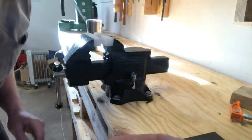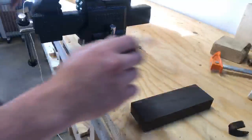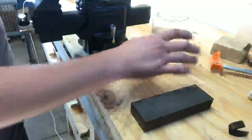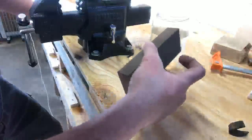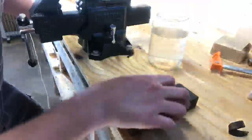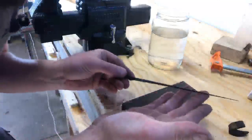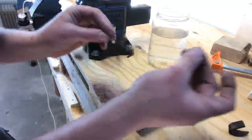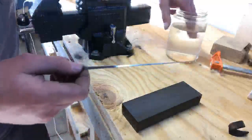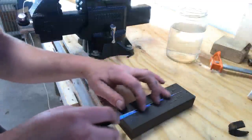Handy dandy vice tripod. Okay, that'll do. Next thing, this is a Norton India stone. I think it's medium fine. I use it for honing because we've done all the metal removal that we want. Now we need to hone that burr off there. Just take a little bit of water and put it on there